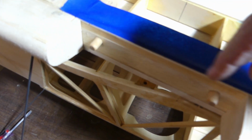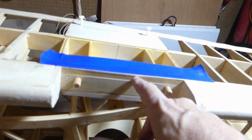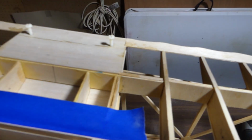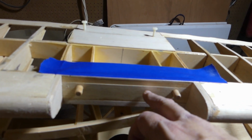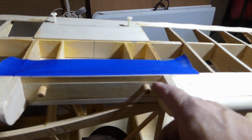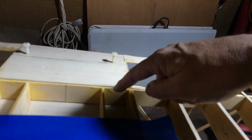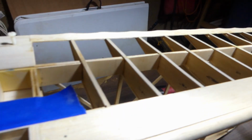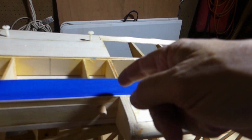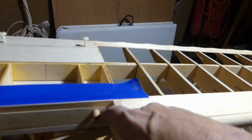And that's going to be the quickest way for us to try to get this thing straight with the least amount of issue, because I do have some of the spar right here. And I think the spar, because the spar itself is made out of balsa, your structure there is coming from the plywood. It's coming from the doubler in the back side of it. So for me to sand this a little bit off, it should not affect anything. Your strength is coming from the plywood, and the spar is going down. But where I'm going to be shaving off here, it should not create a weakness because the plywood is extended out to here. So this 1/16 of an inch should not affect anything.